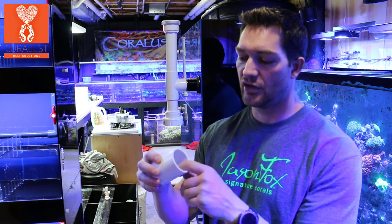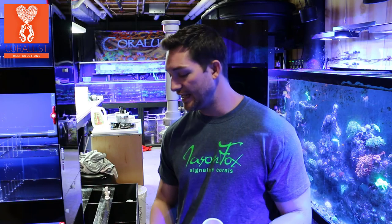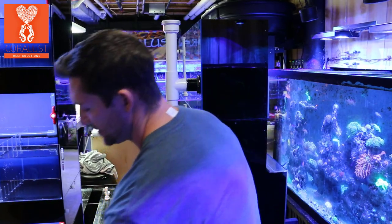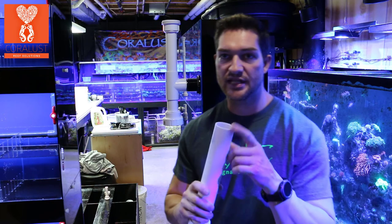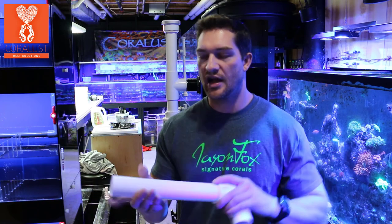Mistake Monday: check your pipes. If you're going to glue something, make sure one hundred percent that the parts fit together, they're the right length, and give yourself room for it to slide in. You can see inside these collars there's a little notch where it'll reach — and that's as far as it can go. Also, chamfering the edges makes a big difference. If you cut a piece and it's really sharp depending on your tool, take some sandpaper and knock those burrs down so it'll slide right in and you don't get it stuck.